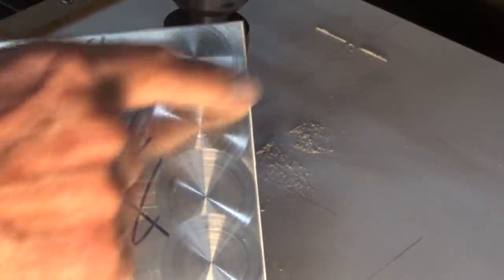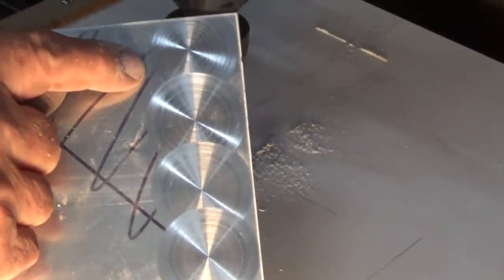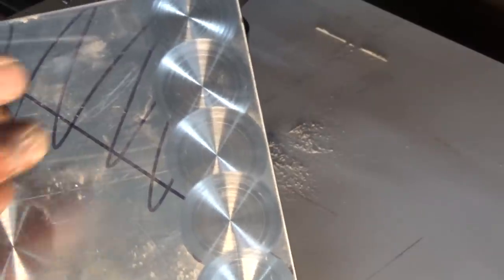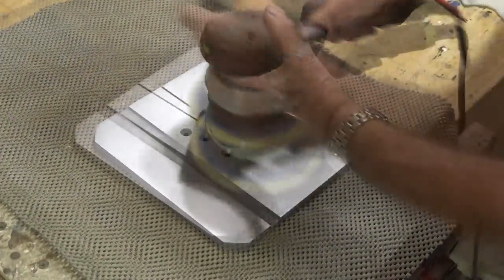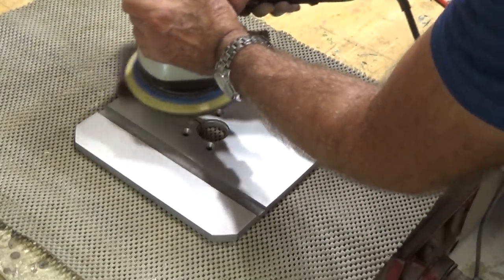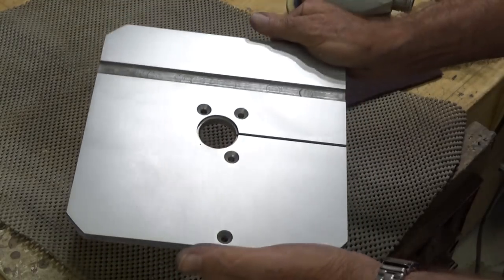If you do this for the first time, the pumice may not be fully embedded into the surface of the cork. And that was the very first one that I did. And you see it didn't quite get out to the edge, but the subsequent ones are fine. So do get a bit of scrap, try it out first, make sure you got the cork charged with the abrasive before you go on. So at least that's a nice even texture before we go on to the engine turning.